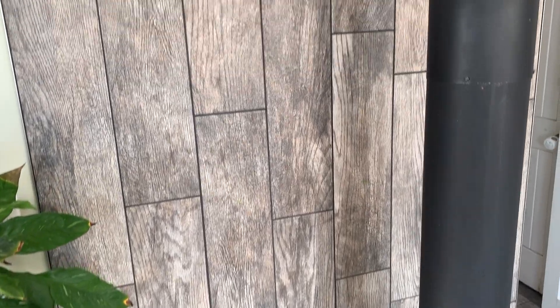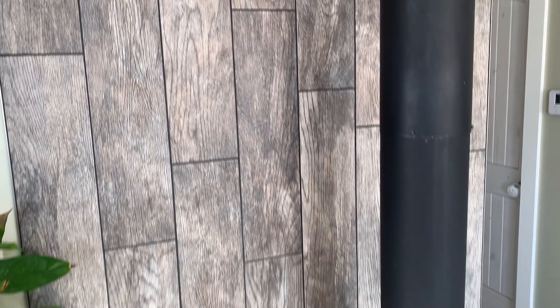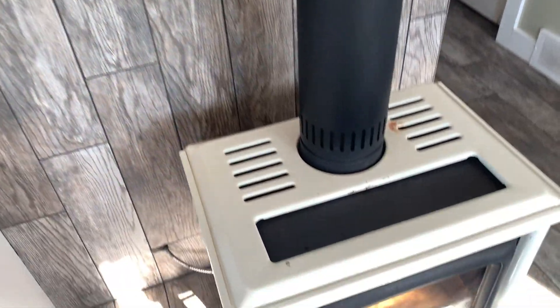I also really like using white or light-colored siding. I don't want the sun heating up my wall — that's hard on the structure. I want no solar gain on the wall, but I want all the solar gain on the glazing. When the sun drives in through the glazing, I want it to hit dark thermal mass. That's why I use this dark tile, both on the walls and on my floor.